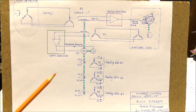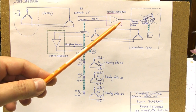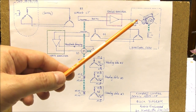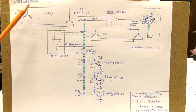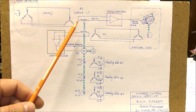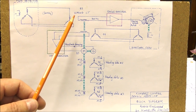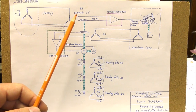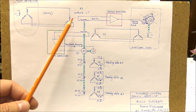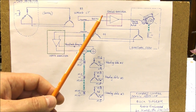The second requirement is to have a slaving of the gyro, because there is a drift of the gyro with time. So you need to synchronize the gyro using the flux detector. For that purpose the flux detector is connected to a second control transformer, B3. On that rotor we have an image of the difference between the heading of the gyro and the heading of the flux detector. So that signal is fed to a slaving amplifier.